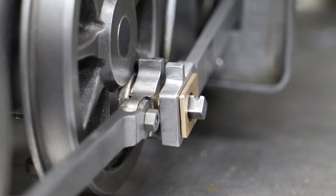The other issue that arises here is the gap between the front coupling rod and the big end of the connecting rod. This gap should be down in small fractions of a millimetre, but currently I've got well over 1mm, which is a combination of that 1mm change in centre line and half of the reduction in thickness of the big end from Don's design, so round about a total of 1.2mm. This is not a show stopper for me, so it doesn't stop me from carrying on with the build and it won't stop the locomotive from running, but it's pretty damn ugly.